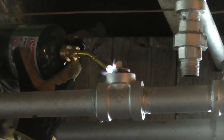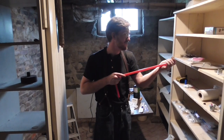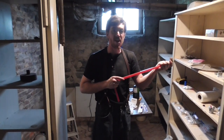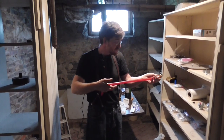In the hidden basement areas underneath the house, we were able to save some time, money, and aggravation by using a material called PEX. PEX is used extensively in plumbing, and there's a heavier duty grade used in heating systems. It's about a third the cost of copper and, very importantly, non-corrosive.